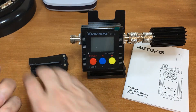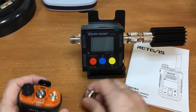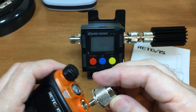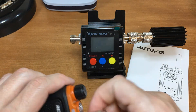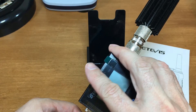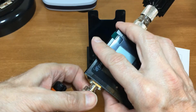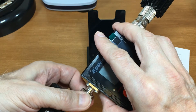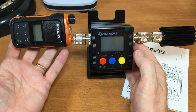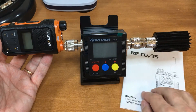So let's put it on the power meter and see. Put in the battery. This is SMA male, and this is SMA female. It's easier to screw that in snug. I'm keeping it loose so that I don't bind as I'm turning, and I'm going to have to kind of support this. This is a dummy load, rated for 20 watts.